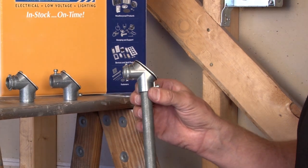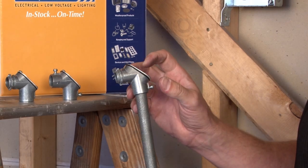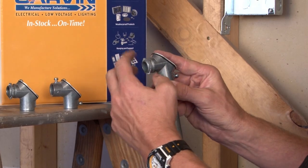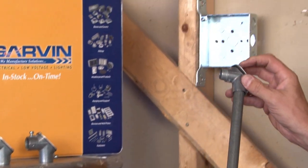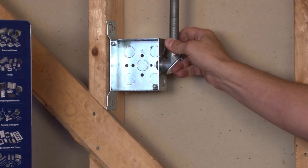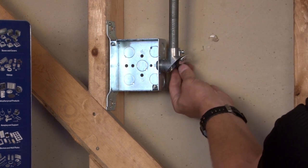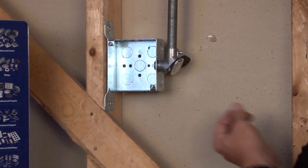This particular item is a set screw version that fits on the EMT conduit and it has a threaded box and enclosure connector end on one side. An example of how this might be installed is like so. As conduit comes in, they pull the wire through, feed it back into the box and terminate their devices.